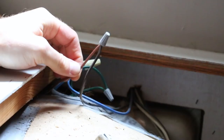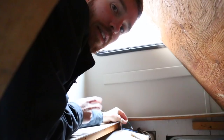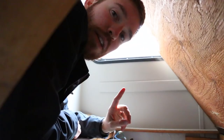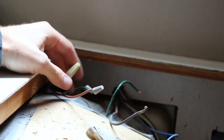I'm here underneath the bed in the back of the RV — there's the back of the hot water tank. Down here I believe is the cold line and up here is the hot line; I think this is a bypass valve for the hot line. I'll make sure to remember that when reinstalling on the new unit. I'm disconnecting these so I can get the unit out first, then I'll move to the electrical. I made sure to take a photo of the electrical lines: I have a red, a blue, and a green coming from the RV to the unit, and from the unit I've got a black, a blue, and a green — wired black to red, blue to blue, and green to green. There are also some other lines I'm assuming are the remote lines for the ignition switch.